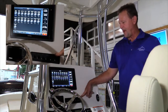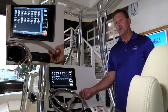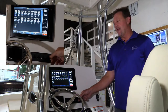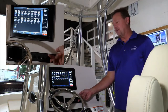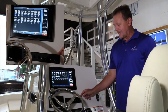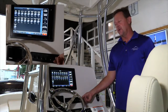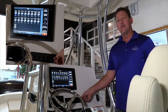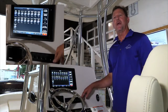The next switch on the switch panel is actually an accessory switch put here for you, the owner, to be able to add any circuit you want without having to worry about tapping into C-Zone. Working with your Pathfinder dealer, this switch is going to allow you to add a circuit of your choice. Lastly, we've got a button for our horn circuit — this is a momentary switch. If you hit the button, you'll engage the horn. That is also separate to C-Zone and independent on that switch.